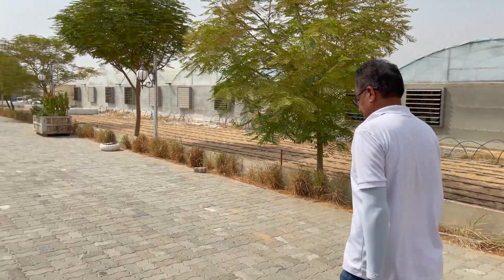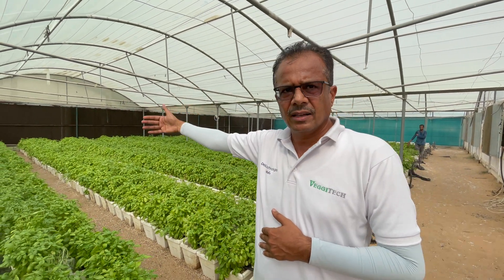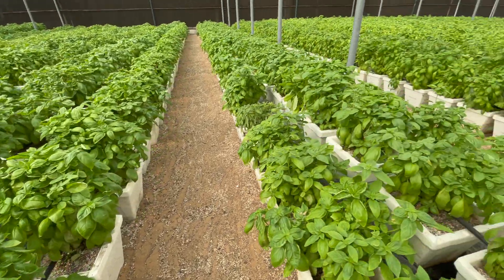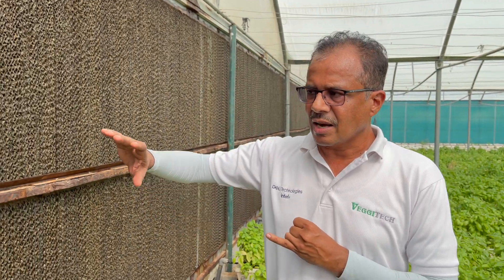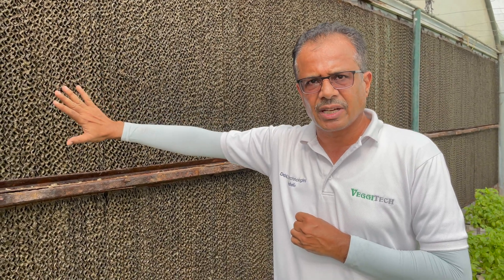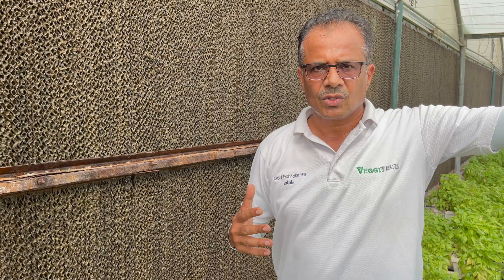This is the original fan and pad type of evaporative cooling system greenhouse, where we have a pad on one end and the fan on the other end. The cooling is based on the principle of evaporative cooling. Cardboard and cellulose material make up the pad — water trickles through it, goes to the tank, and recirculates. Hot air from outside passes through this cooling system and the fan on the other end sucks it up, so you have a cool breeze flowing.